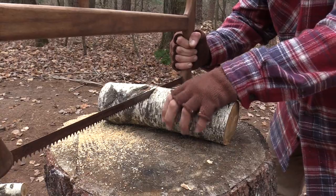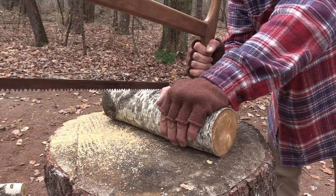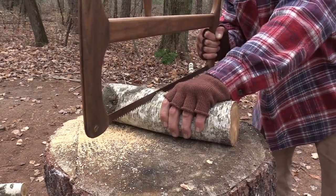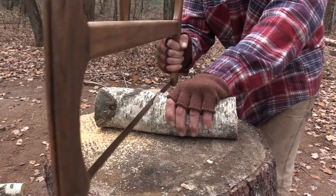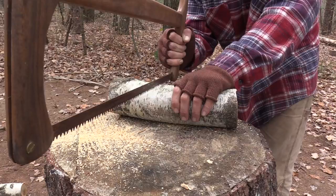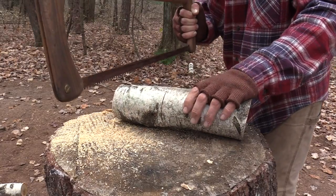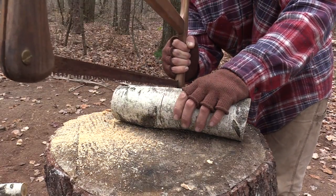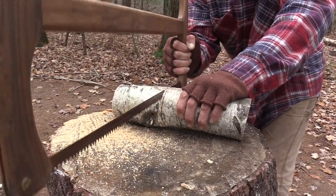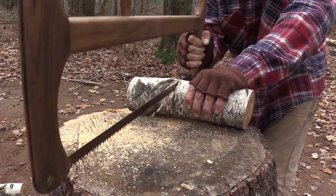What I'm going to do now is rotate this piece of wood and do the same thing all the way around it. My cuts are going to be off a little bit but that's all right. All I'm going to do is continue with this cut, again making it to depth, and just continue around until I can get those cuts to meet up — which is right there.